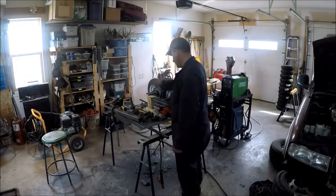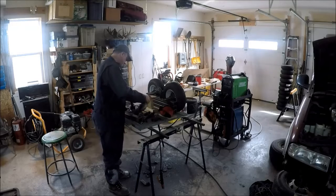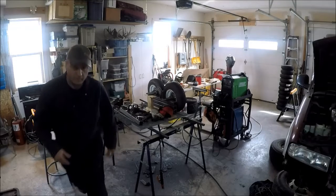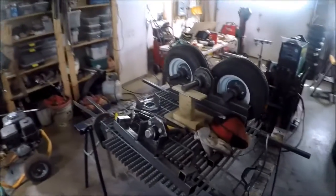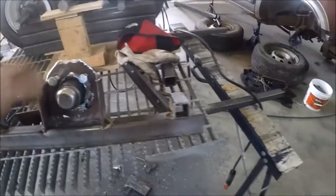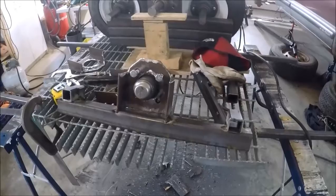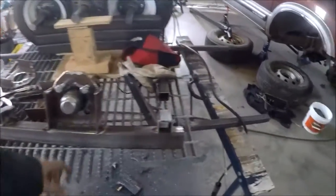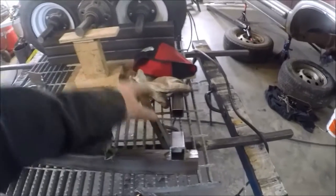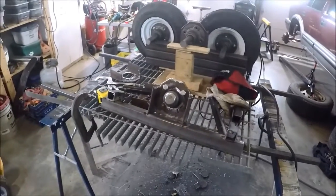Working on these brackets — I'll bring the camera over and show you close up. You can see the flange here sits just fine, these are bolted on, tacked for now just a couple spots. I'm going to let my children work on doing the final welding if they have time or if they want to — it's a good experience for them. The hub sticks out a quarter inch here and we'll have the hub stick through another half an inch, so this should clear the three inch beam. Going to work on fabbing up the other three of these to make four for one side.